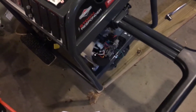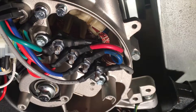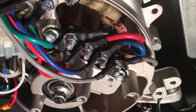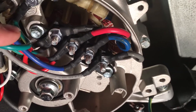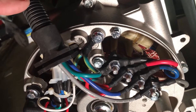So in this situation, because I'm connecting it to my house, I'm going to break the bond, and the bond is real simple. Hopefully this is a little more lit up now. On every generator head there's a ground point, and on mine it's right here. You can see this green wire goes up into this cord which goes up into the electric panel of the generator.